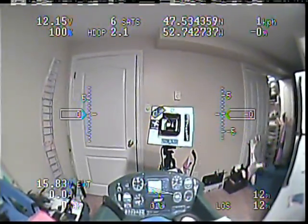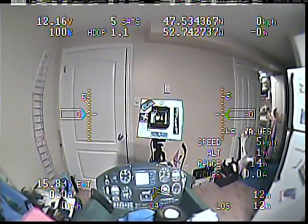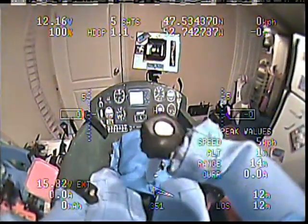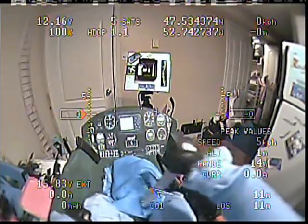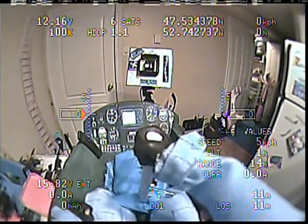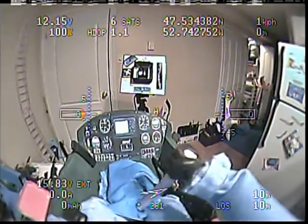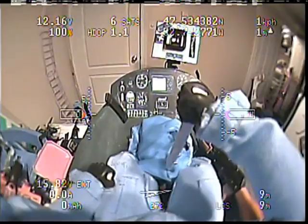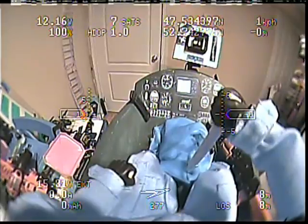I've got the PPM running to the Dragon OSD from the receiver, which leaves my aileron and elevator ports open on the Dragon Link RX. I just put an extension from the elevator servo and the aileron and made sure I situated the servo so it would match — right, left, forward. It would be cool to have throttle right here, but that may be another little add-on after.